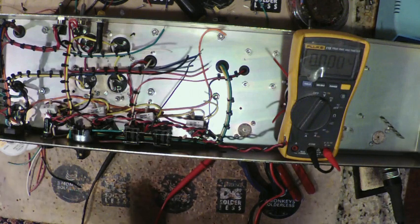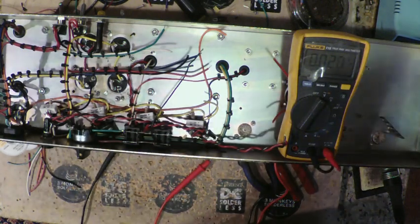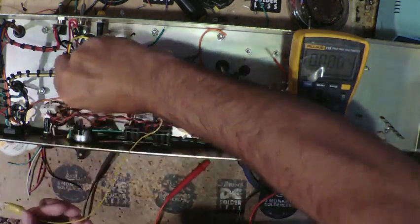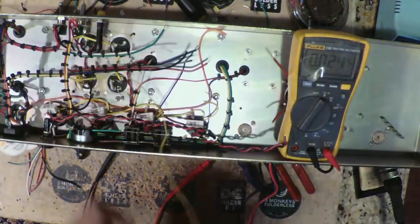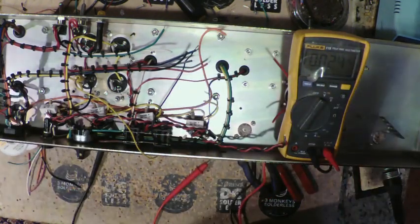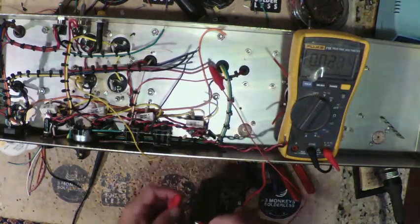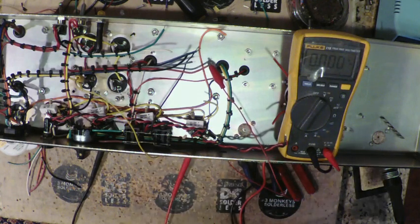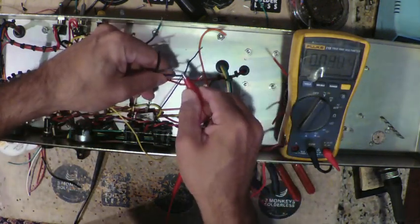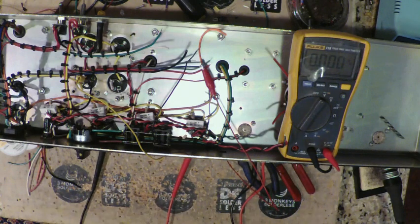I've got some alligator clips around here. Here's one. I'm going to take this alligator clip, and it'll be on the center tap, because I don't want to futz around too much with poking around. Then we're going to attach the other alligator clip to one of the legs of the high volt winding on the power transformer. And then we're going to make sure that every other wire is not going to be touching the chassis. That shouldn't be, because we don't like to melt things and make sparks.